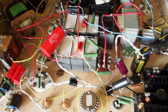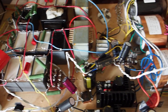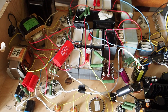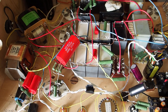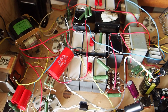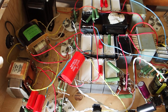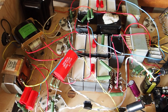Yes, it seems like it has got more components and the component quality could further be increased. However, for a three-stage design — because I didn't want to use high gain tubes and my EL33A didn't work — it's still a three-stage design and yes, that is a little bit complex. Especially as you start separating everything out you get a lot of ingredients in the amp, but it's not really complexity. It is very straightforward — each stage is optimized by itself.